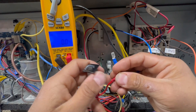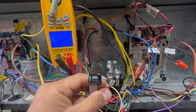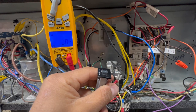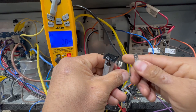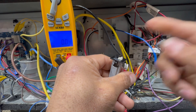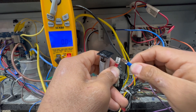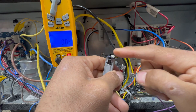Let's go ahead and do a little demonstration. Look at this resettable 3-amp fuse — instead of putting a regular fuse, I put this because it's resettable. If it pops, I can reset it instead of replacing it. But look at what happens when they both touch each other. I'm going to touch them together right now. It popped — it popped because it pulled more than 3 amps. You can see that spark. So these two have to go to a load. If they touch each other directly, it pops the fuse.